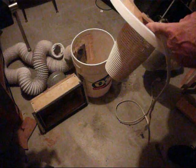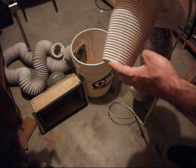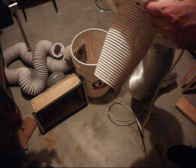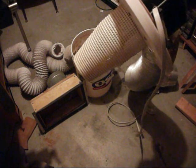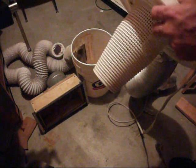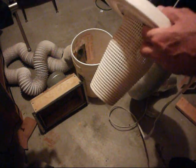This is attached to the lid of the paint bucket with a piece of wood, and the filter from the water pump — which is what this thing is — is screwed onto the bottom. I use the filter from the water pump to support a furnace filter that I wrap around here, which prevents the furnace filter from getting sucked up into the blower.